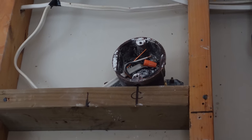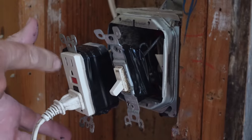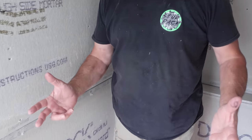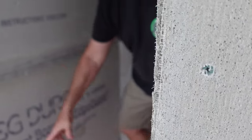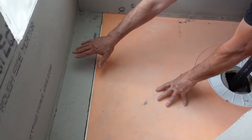Got all the electrical done — came out great. We replaced the mud ring and put electrical tape around there because the ground fault was on a separate circuit. Now it's nice and safe. In the shower it is ready for waterproofing — our last step before we finally tile this thing. We're going to put mesh tape and then set all the seams, the outside corners, all the inside corners. We're going to come down here and put KERDI band between the pan and the walls, a larger piece of KERDI between here and the wall where we had to fill in, then set our drain. Let's get the thinset and get the waterproofing done.